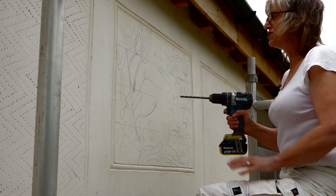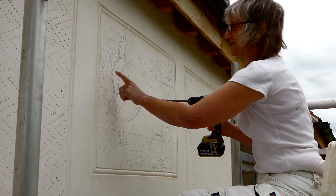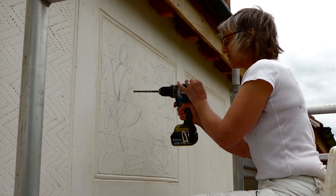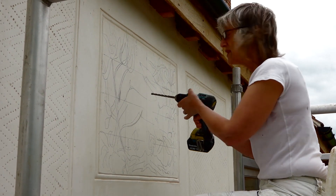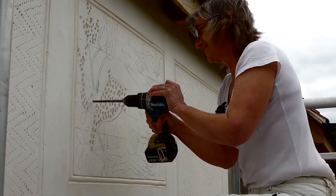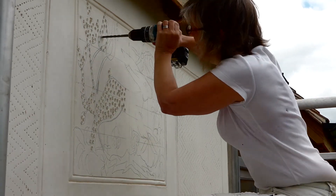When I was looking at the background area, it's flat and it's already set. So all I need to do is key the areas where my parget will be, and the background will be the same as the rest of the building. I'm using a 10mm drill to do this.